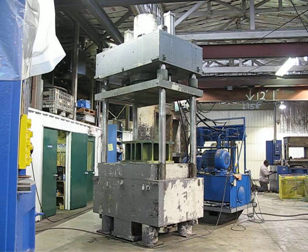Currently, we were filling the main ram to push the press down, and we were pulling it back with the side cylinders. If we were to pre-fill that main ram and do everything with the side cylinders, given the same flows, it would be much faster. So that's an example of the 400-ton press.